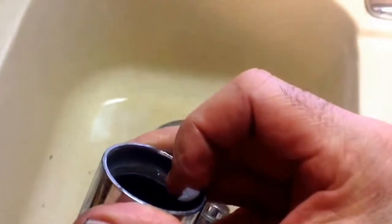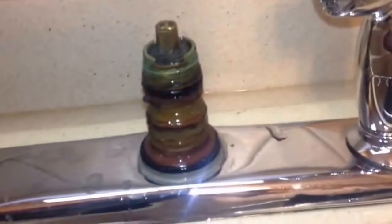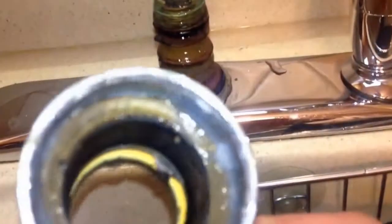Get them back in the same grooves — one on the bottom, one there. You need to smear the grease in the bottom where the seal rides. Clean out the old grease and put in the new. We got the O-rings on there and we greased up the bottom — the inside where the rubber hits on both sides, the top O-ring and the bottom.